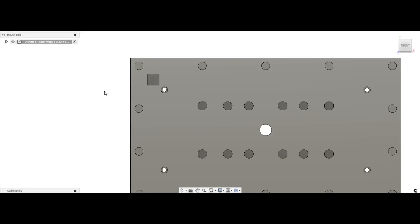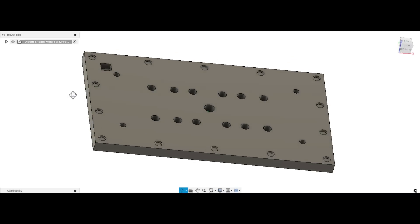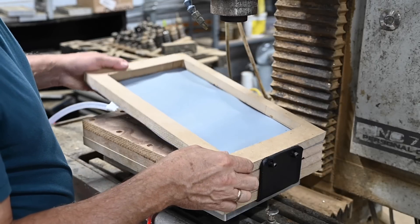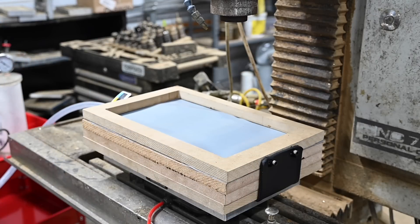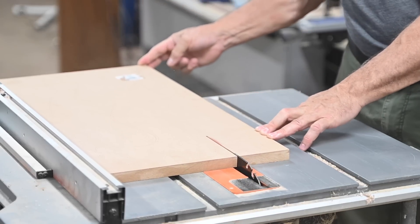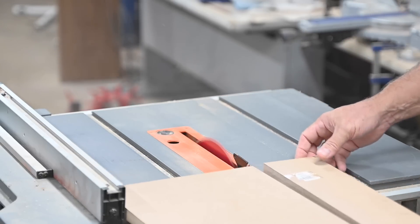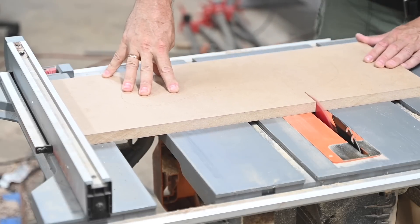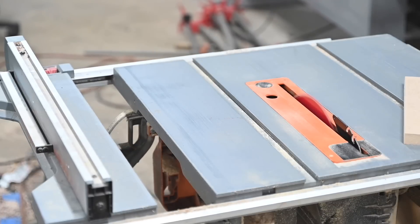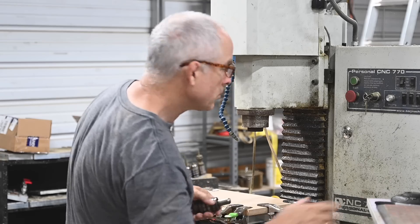From the outset, this build was a little speculative. I've been planning this design for several years but I've only just gotten around to finishing it up. I've never built a vacuum table so I wasn't sure it would work as planned. Spoiler alert — it does amazingly well. The whole thing is made from MDF which has a lot of advantages when working with it, but it pretty well sucks for anything that might get wet, twisted, torqued, yanked, or abraded. Why MDF then? Simple — it's cheap and easy to work with. This was really a test to see if the idea works, and it does, so when this MDF table starts showing wear I'll remake it from aluminum, which will last pretty much forever.